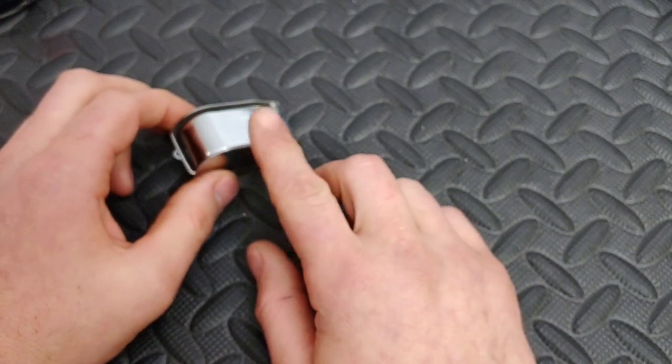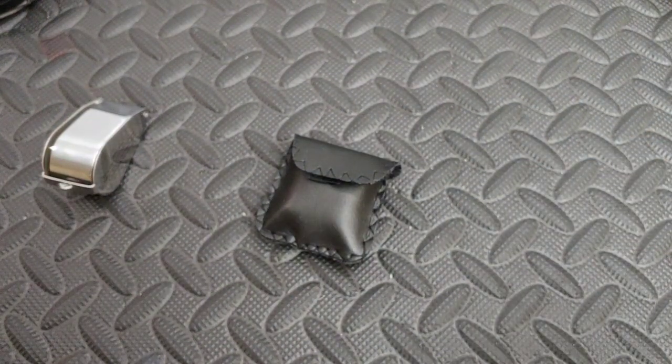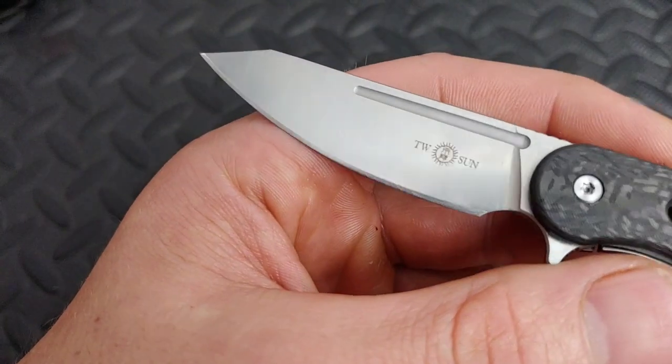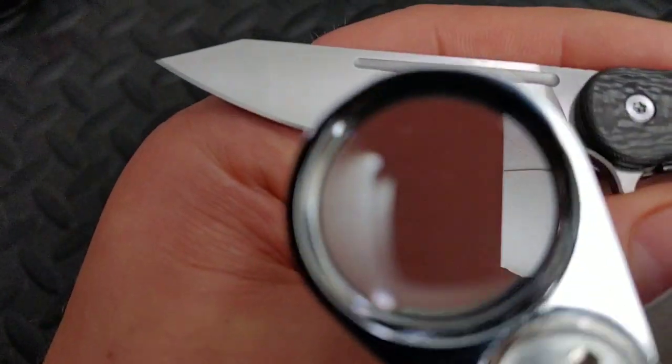You've seen how all that was visible from this little loupe right here — under ten dollars. The other one I can use on camera but it's a lot harder to hold. Now let's look at a good edge where there are little tiny details that could be better. This edge is great — it's very sharp and looks really good. It's a low grit so you can really see it. You're going to notice something at the tip and maybe a couple other places because it's not finished yet, but we can identify the issue. The scratch pattern is pretty decent, and you can see that shadow going side to side — that's a change in angle, but not bad — I just needed a few more passes to cover it.